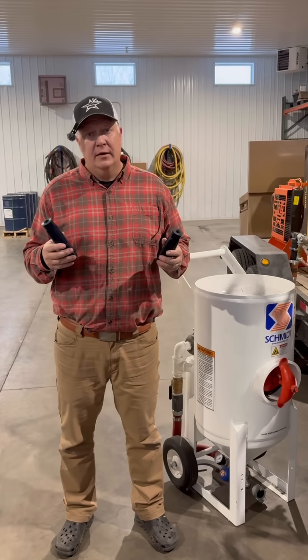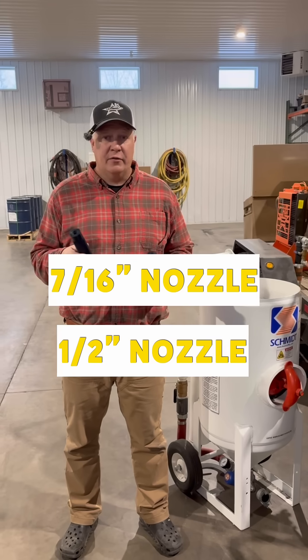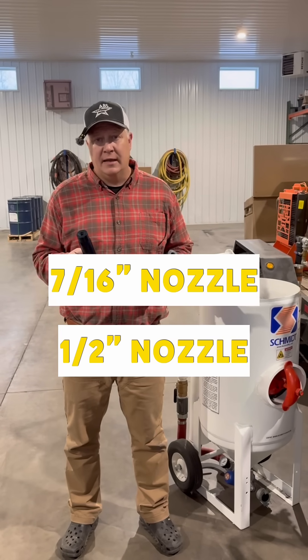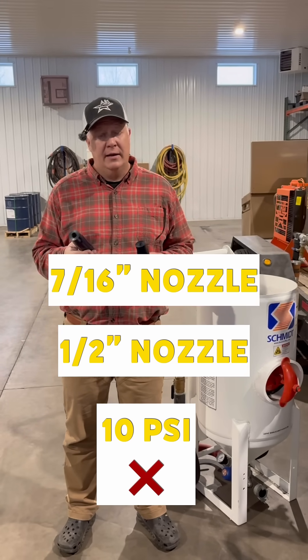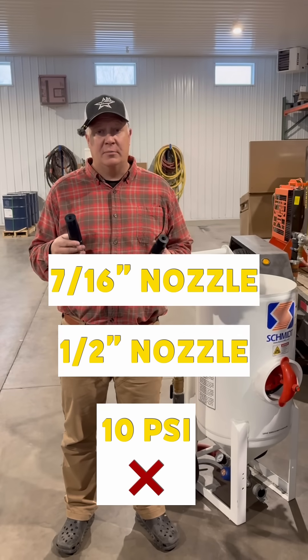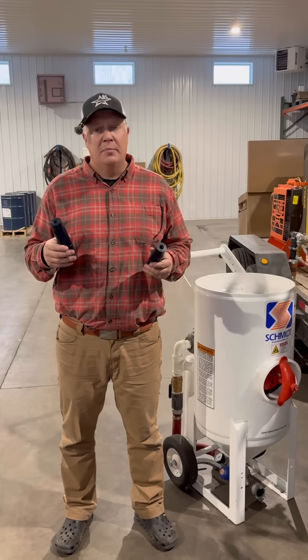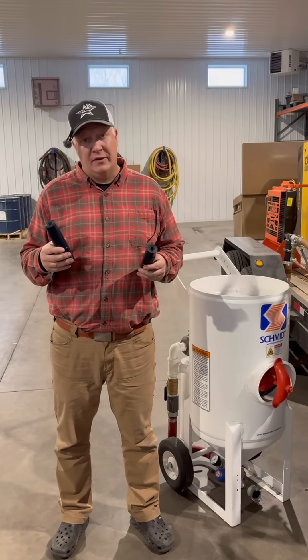That's not significant. Now as we get up into larger nozzles — number seven and eight — I have some friends who have documented pressure losses with number eight nozzles at 10 PSI. That is significant. You do not want to run your blast pot at 10 PSI. That is like choking your pot. That will cause you the blaster to buy a whole lot of extra micro valves, Thompson valves from people like me. I would not recommend it — it would not outweigh the benefits.